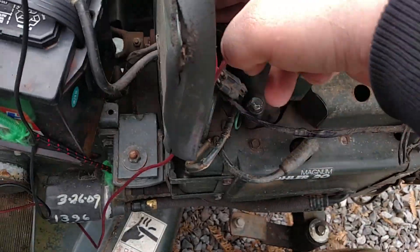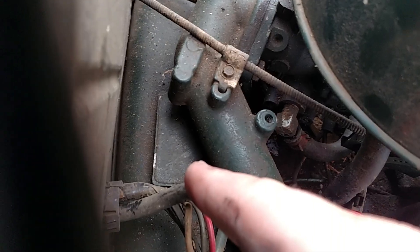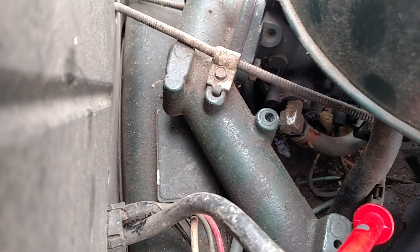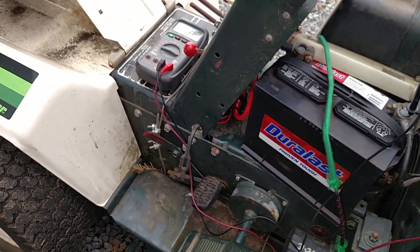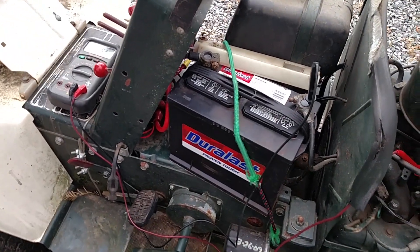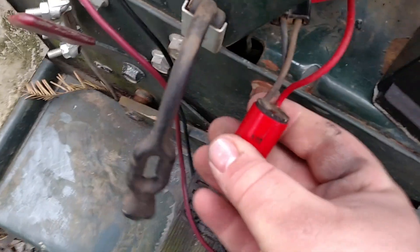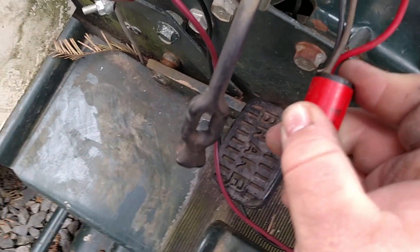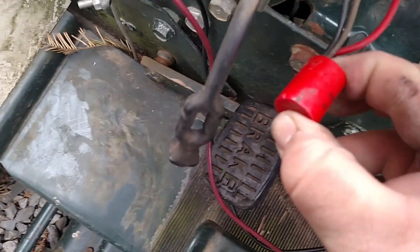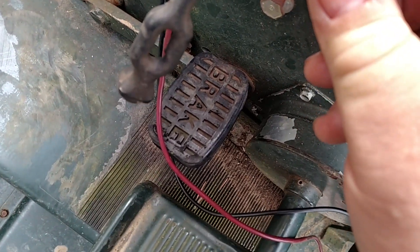The problem is this little box down here hiding under the intake — that's your regulator. That's actually what's bad on the tractor. That should get us back up and charging the battery. I had made another video previously saying that maybe this other component was the problem — that it was a voltage sensor and maybe what charged the battery. But it turns out it's not. It's just a sensor — I think it's a diode. That's all it is.